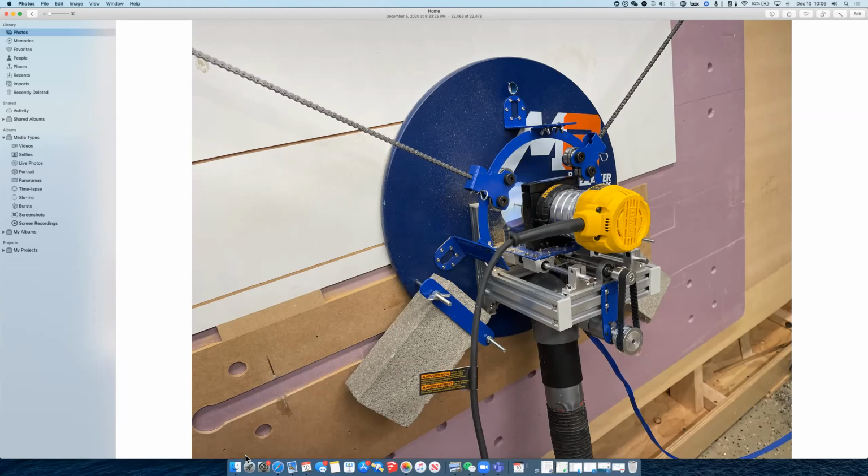It works. The struggle that we've had with testing metal sleds is just that friction. It's sliding across, especially in this picture, it looks like they're cutting some white melamine. You know, the potential marring of your cut material when sliding a piece of steel. If it gets any kind of scratch or nick in the sled, then that can turn into a negative impact to your cut.